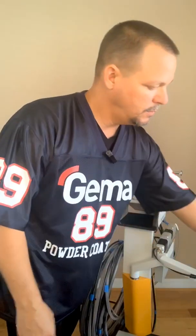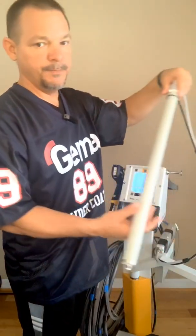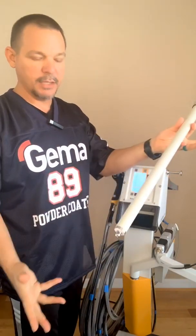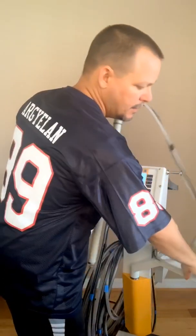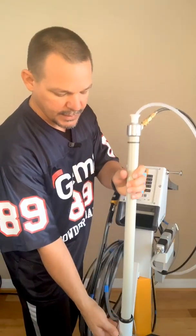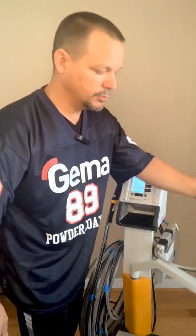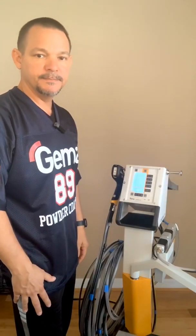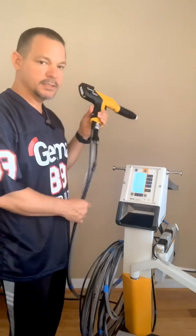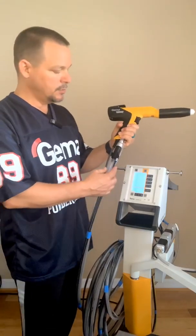and pushing air and powder down about the pickup tube. So we'll pick up the pickup tube and just blow it off with compressed air, wipe it down, making sure it's clean. The arm, you'll blow a little bit of compressed air to make sure it's clean, and then set it back down in the pickup tube and the arm holder, and then set it off to the side.